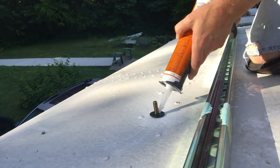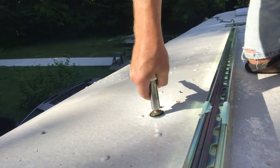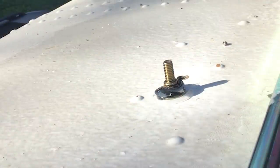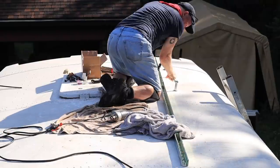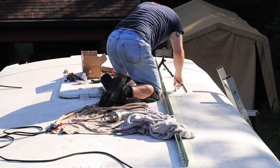Our first couple of attempts were a failure. I thought it would be a great idea to put the silicone sealant on, then the rubber washer, then the other washer, then the nut, and screw it down real tight. My washer was cutting my rubber seal off. When I put a layer of silicone down, it acted as a lubricant and the neoprene washer just slid and squooshed out the side. So we cleaned it up, took all the silicone off, and tried it with no silicone on the underneath side of the rubber washer. It went down really smooth — the rubber grips the paint of the roof and makes a nice sealant.